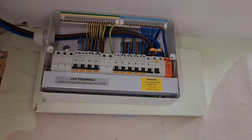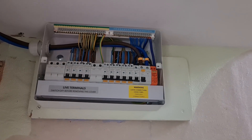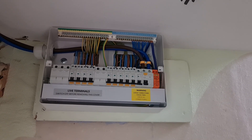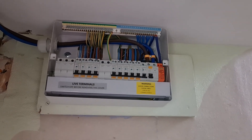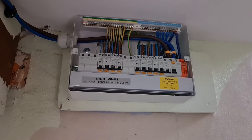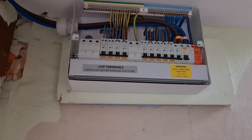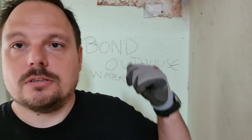Let me run through the circuits: we've got a cooker circuit which is 6mm twin and earth, a kitchen ring in 2.5mm, a 20 amp circuit going to an oven, a 20 amp circuit to the workshop, a 20 amp circuit waiting for the oil boiler — that's tucked in the back, boiler isn't in yet — a socket circuit to upstairs, a socket circuit for the lounges, and two lighting circuits up and down. Don't forget the bonding — Matthew's working on that now.